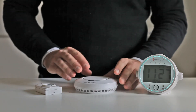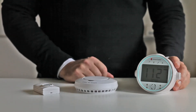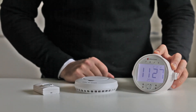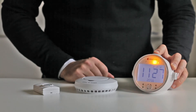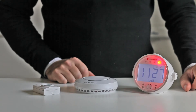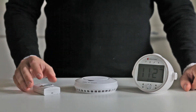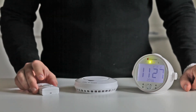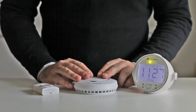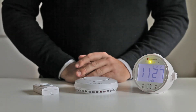It has now been set to the very same radio key as all the other transmitters. In order to pair the entire system, I do as I always do — put it into pairing mode, push any of the transmitters, and the system is now paired. Let's try it out with the push button transmitter to start with. The door LED lights up, and we test it with the smoke alarm, and the fire LED lights up.